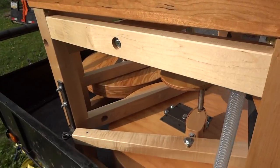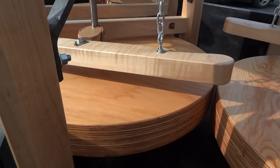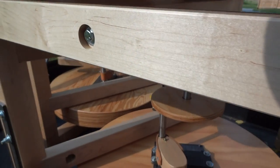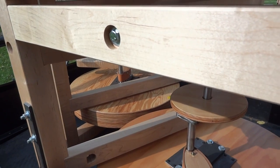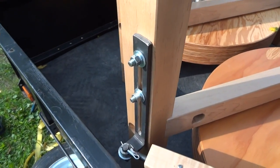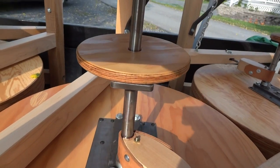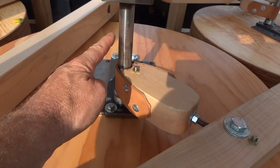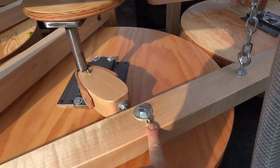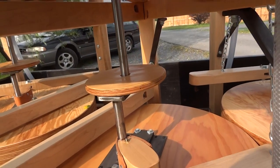The flywheel itself is actually hollow — it's made of marine ply and it's a hollow construction. It has four compartments which allow you to add ballast to it. You must be careful, of course, to add the same amount of ballast into each compartment. It's very sturdily made — the metalwork is very sturdy and beefy. You have a leather strap here that goes around the crankshaft, the offset shaft. It has a grease nipple there, another one here, and also grease nipples up underneath for the top bearing and one down underneath for the lower bearing.